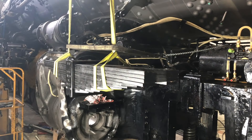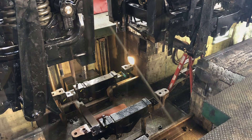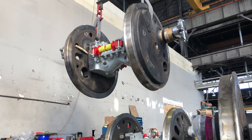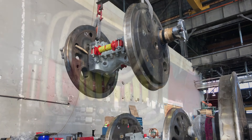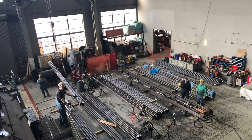When this was completed, we then began installing the rear engine spring rigging, just like we did on the front engine, fitting everything into position and lacing everything back together with all new pins and bushings. We have made very rapid progress with our overhead crane wheeling the rear engine and have progressed beyond installing tubes and flues, and have nearly all the heavy steam, air, and water piping now assembled on the locomotive.